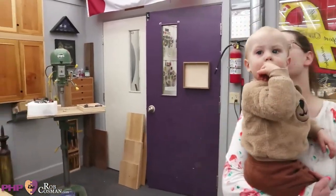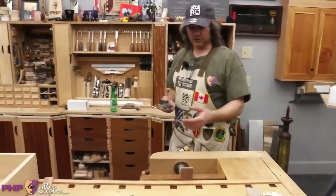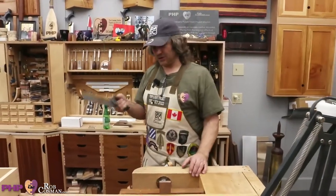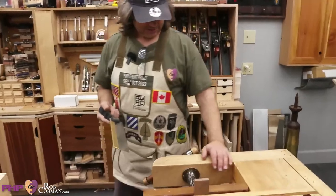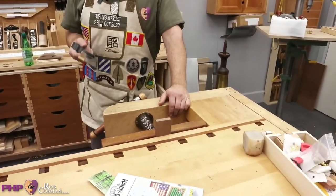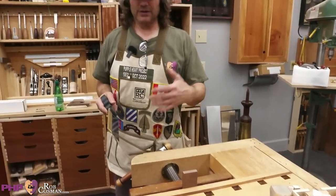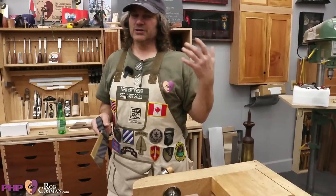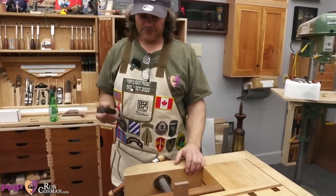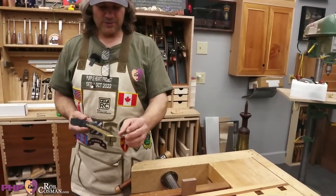That's his Biden haircut. So, your saw, you have to be able to do, this chap I was speaking to, I was telling him, it's easy to get frustrated when you're trying to do this, because if your saw doesn't do its job, then it becomes very difficult for you, because now you have to go in and literally do with a chisel what the saw should have done on its own. So there's two things about a saw that have to happen. One, you've got to be able to start it accurately.